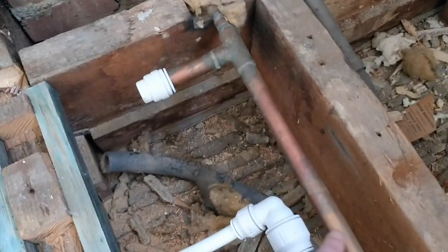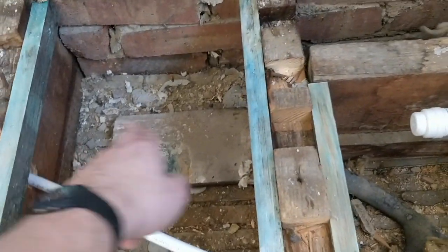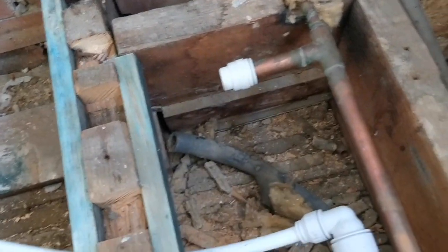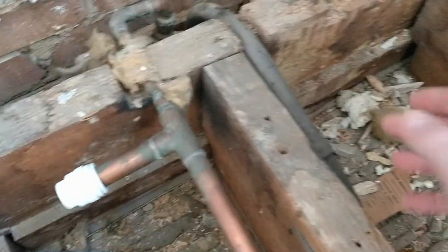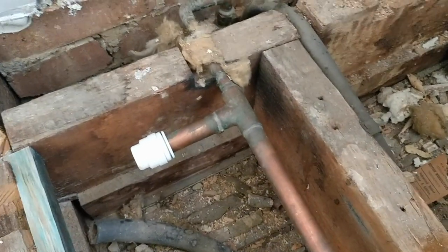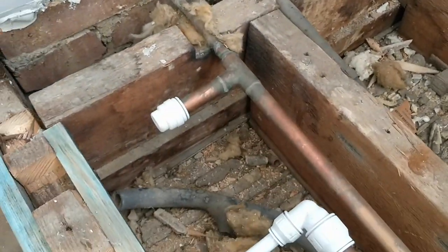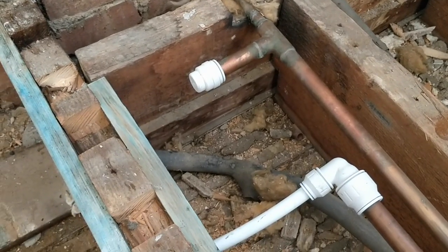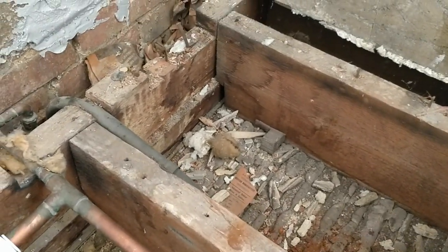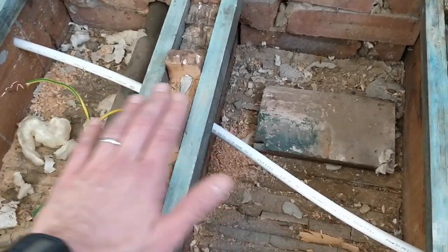These pipes here are the same height as this batten. I checked that, I got the spirit level across all of this, and that cap there does sit at this height, but that's okay. It's these that are difficult, I guess. That's where it becomes a bit of a challenge. So yeah, that's what I'm thinking at the minute. Genius or madness, I'm not sure which yet. But I think that might be an effective way to stop me having to cut lots of little bitty bits and prop them up in different places and just have one continuous sheet of ply that goes down across here and is stronger the whole way across.